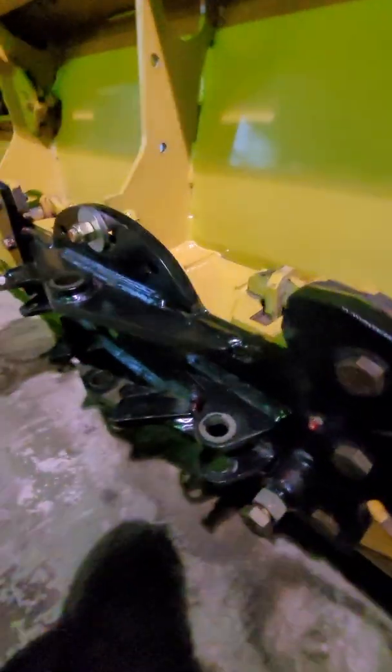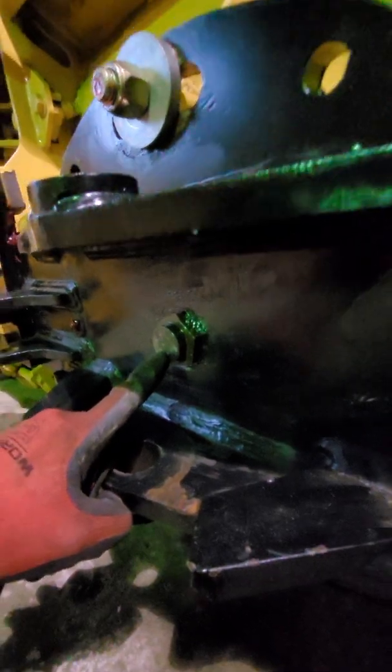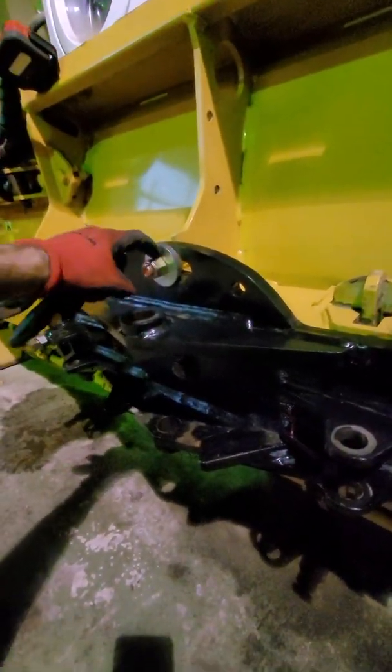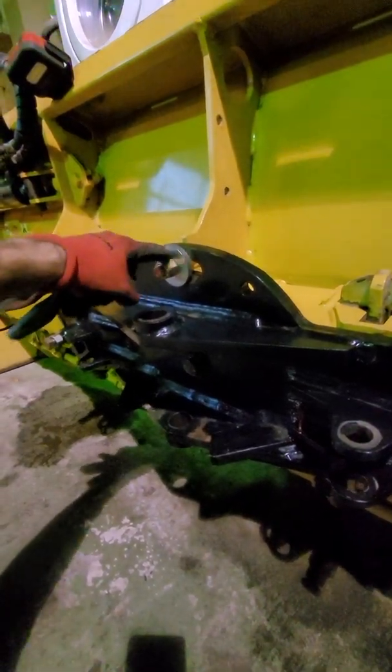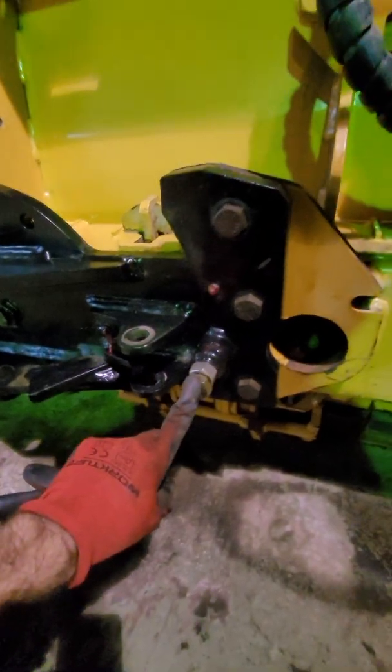This is the order in which you want to adjust every bit of this swivel plate. You have an axle bolt right here. This axle bolt right here is the main pivot point, and then you have a support stud right here on the top, which is adjustable as well. It's just a threaded piece, a bolt welded in the back here. And then you have these tension bolts here, which have a little wear pad and put pressure on the swivel plate.